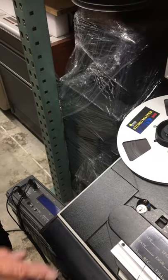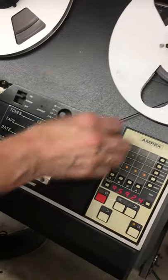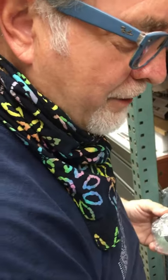It doesn't have that other piece of rubber pushing all the time — eventually you're going to wear something off. By doing this, it's a feedback loop that makes these guys go. It's servoed to that. Very, very important — never turn these reels when the tape is loaded. If you wanted to move the thing forward like I'm doing, you never grab this reel — that stretches the tape. It will freak out because it's always servoed to this. It's going to fight you and it'll break the tape. Never do this.